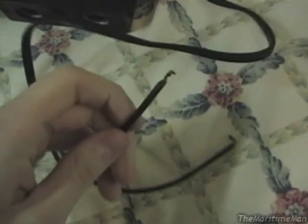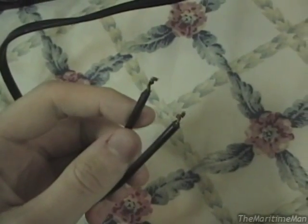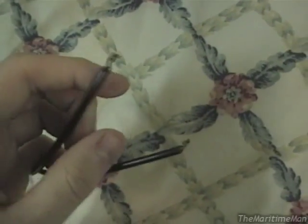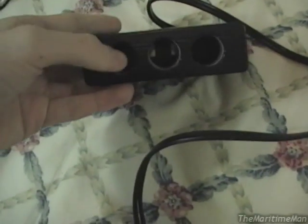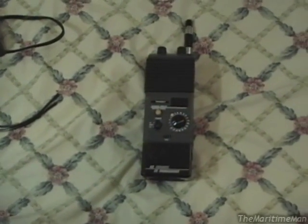And how I decided to do that was pretty simple. I have this thing here, just bare wires, and then on the ends 3 cigarette lighter jacks. Just wire this up to my 12 volt power supply with my multimeter in series to monitor the current, and then plug an adapter up to this, which would then plug into the power adapter jack. Pretty simple. Well, I did that, and it worked just fine.